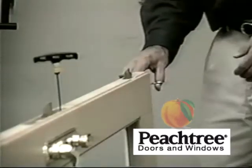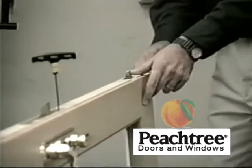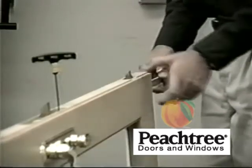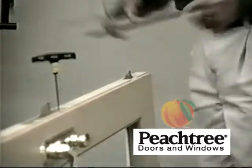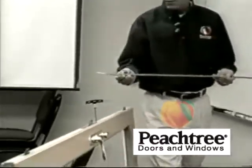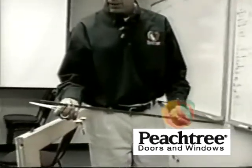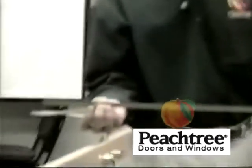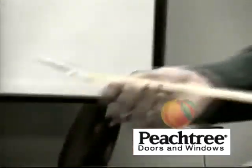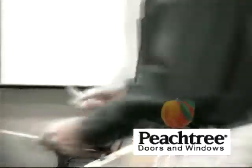With the plug removed, you go in with your forceps and can remove the drive bar from the mortise lock. Again, push down the bolt to bypass the pin. Okay? The top drive bar is marked with a T. You have the same notch for the alignment key, 2 pairs of rollers. Okay? And they are different. Top is different than the bottom.